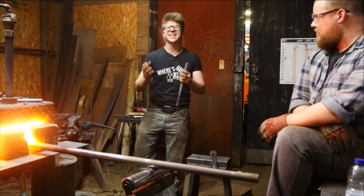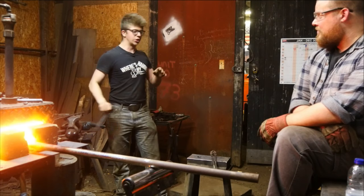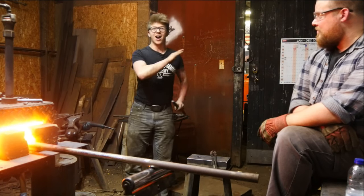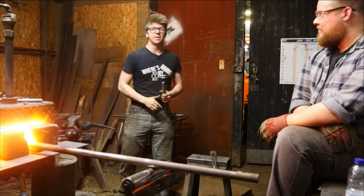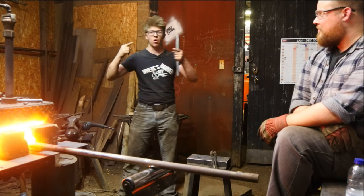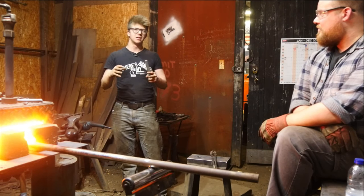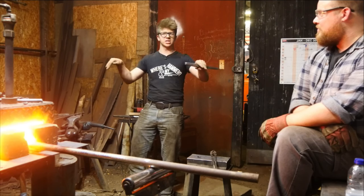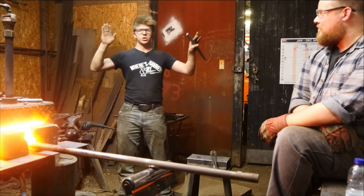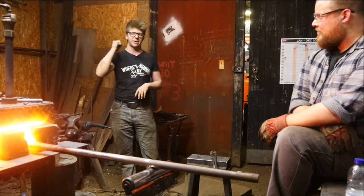You're gonna see that a key thing here is knowing when to stop, flip the billet over, cool the drift off, and go into the other side. A critical thing to avoid is just beating and beating, because as soon as this drift takes the heat out of the immediate surroundings of the hole, you're not gonna drift open the hole, you're just gonna start bowing the plate. It's very difficult to straighten that if all you have is your striking anvil and a sledgehammer.